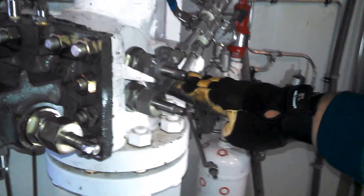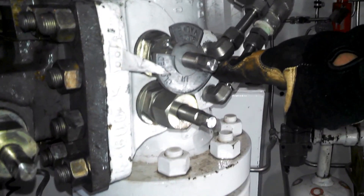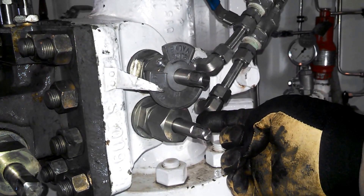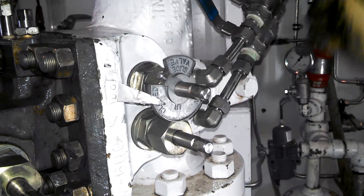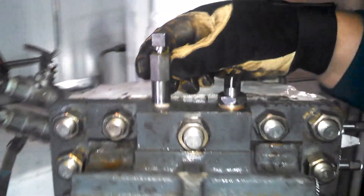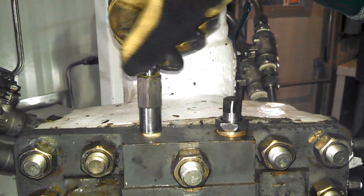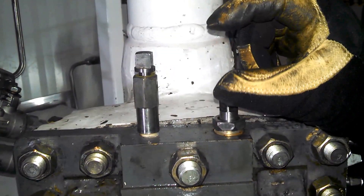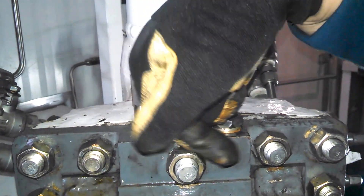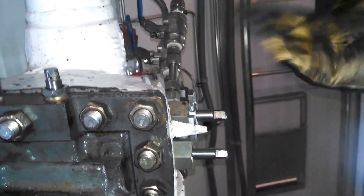Explaining a few of the other parts: your plate goes in between here. Upstream is your static, downstream is your differential — connected up to whatever meter you're using, whether a chart meter or electronic meter. This right here is your greasing port. You pull the screw out and there are little one-inch grease sticks you stick down in there and screw down. That pushes grease through the veins in here, lubricates the gate, and keeps everything in working order.